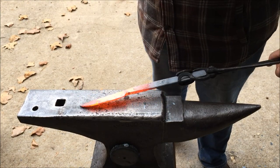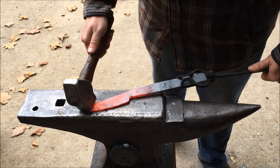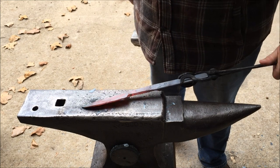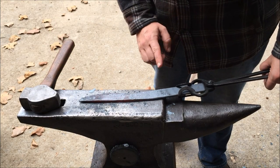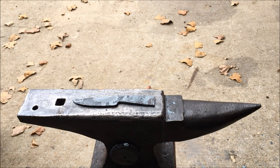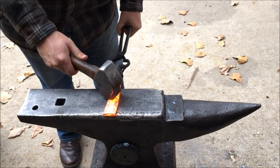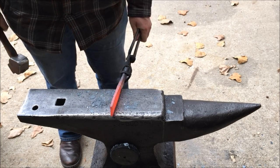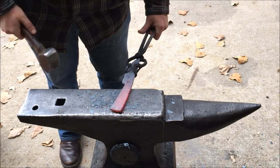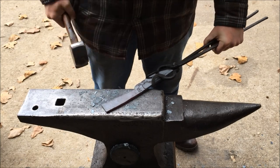Here I'm still working on the edges and trying to make sure I get everything aligned. The blade's pretty much done at this point and I'm just making sure everything is the way I want it before I turn my attention towards the handle. I'm kind of eyeballing how far I want it, then I cut it off. After I've got it cut off I can flip that knife around, put it in the forge, and start hammering on it — maybe stretch it out a little and flare the butt end of the handle out just a little bit to get the handle the approximate shape I want.